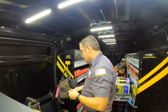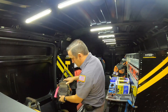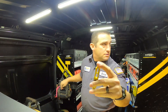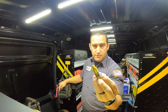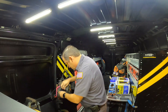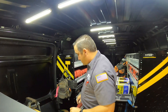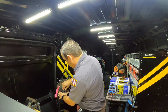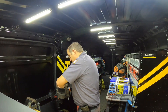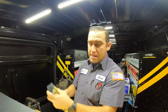Get one of those if you'd like magnetic or non-magnetic tools. In this bag I have a little control fuse puller for those little control fuses. I also have some extra fitting extensions, a little quarter-inch gauge extender, some marking tape for marking valves, and my little peanut gauge — I can extend it when I'm working on refrigerant systems.